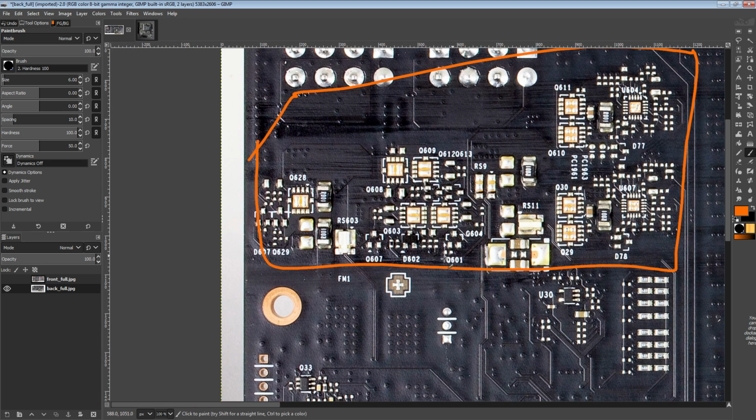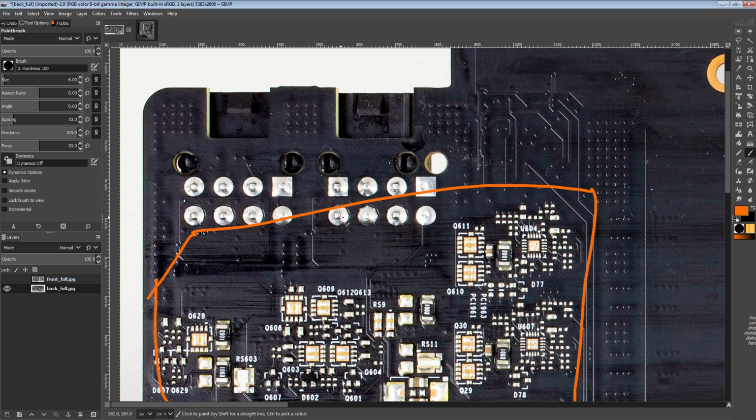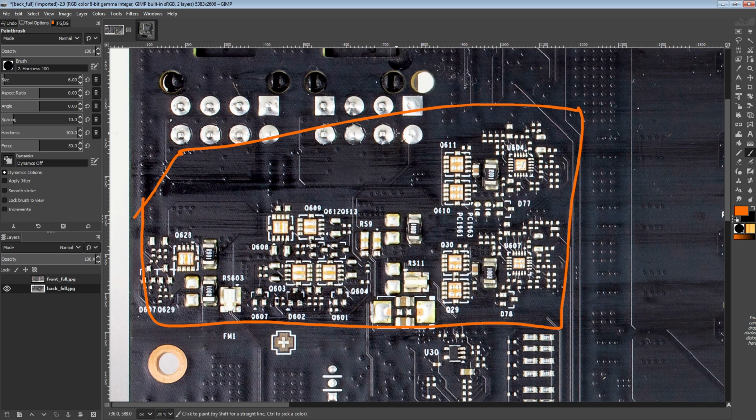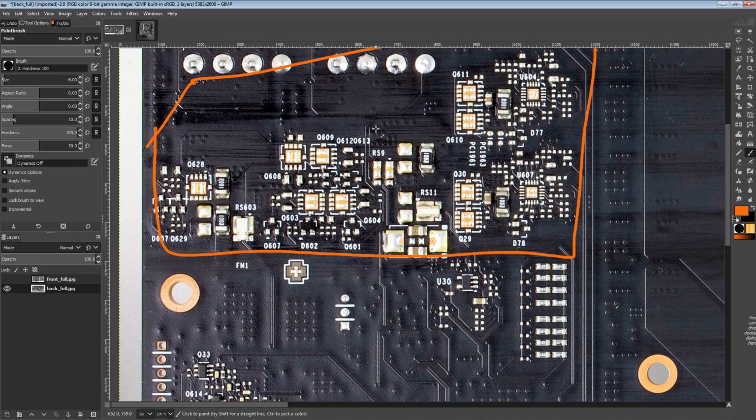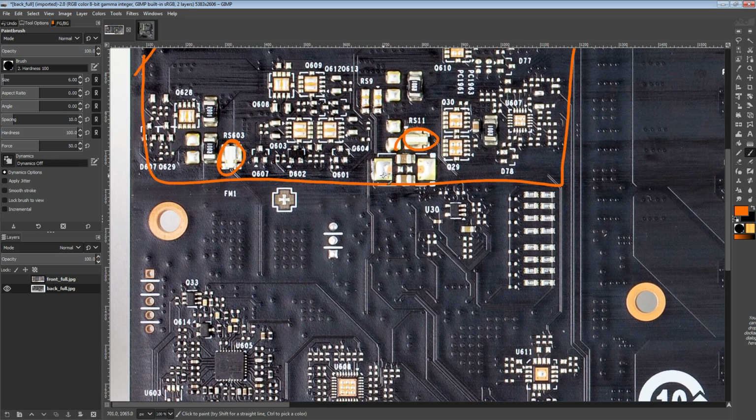Now, MSI doesn't have any of that, so I'm assuming that they've just set their per power connector power limit so high that it's not a concern, which I'm totally a fan of. In my opinion, that's the best way to solve this. Why bother with power balancing when you could just not cause the issue in the first place? But anyway, so yeah, all of that is missing, and here we do have 2 more shunt resistors,